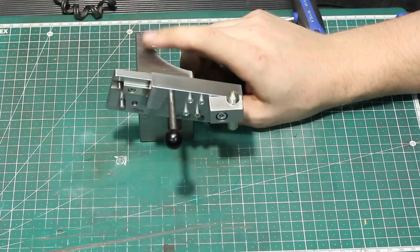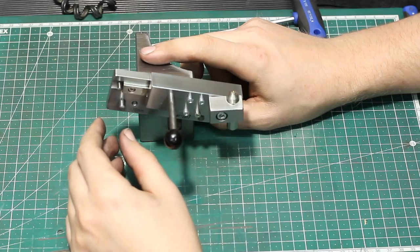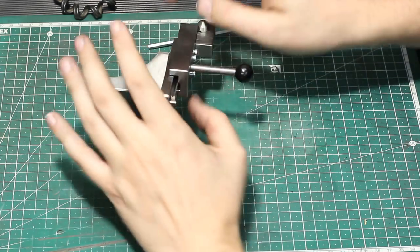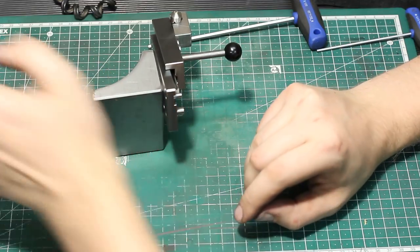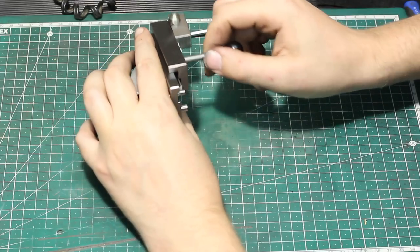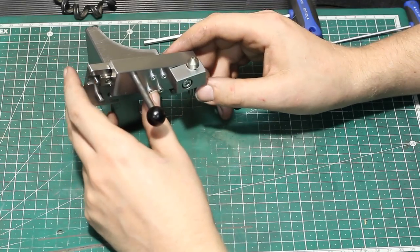There are no drawings for this thing — I built it in about four hours completely without drawings, just holding parts up against each other and machining along. Which is quite fun if you work most of the time after a drawing — but sometimes it's just nice to work along and build something you need right now. To protect the linear slide from the dressing grit, I just take a plastic bag with a hole punched through it for the diamond and wrap it around so the linear slide doesn't get all the grinding grit in it, which would be rather bad. They're not super expensive even if you have to buy them. That's the diamond dresser — thank you all for watching, see you next time.